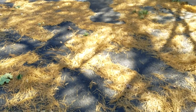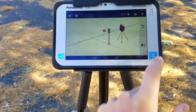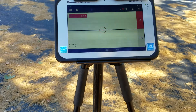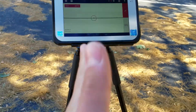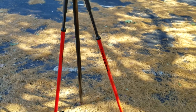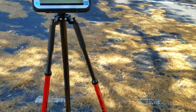Remember, my 0.1 was over there, my 0.2 was over here. If I make my 0.3 back here and measure — this has now created a 90-degree angle directly on that line to where I'm perpendicular. So my line was over there, and now I have a 90-degree line right here. This is really convenient if you have a grid line in the floor, you identify where they intersect, and you need to make a quick 90-degree angle from that grid line.